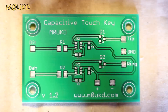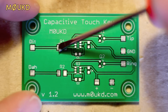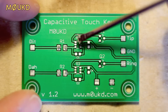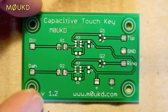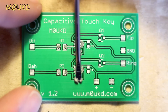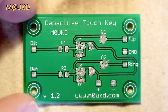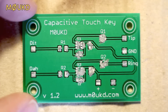Getting the correct amount of solder paste is quite tricky. You don't want too much, you don't want too little — just a nice thin amount on each solder pad. You definitely don't want to bridge the pins on the two ICs. I'll just speed through this bit of the video. Well, that looks about right — a very thin amount of solder paste across the pads on the board.